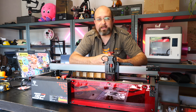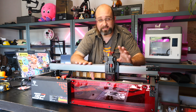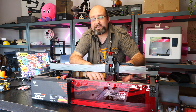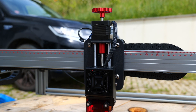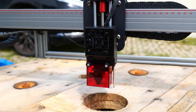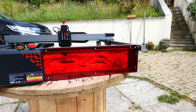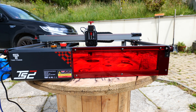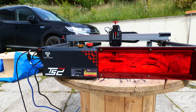You can see some examples of that later in the review. Let's talk about safety first, because that's always a concern with laser engravers. Included in the box is a generic pair of laser blocking safety goggles. However, it also shields the actual laser itself with a block, which should be sufficient in most cases. And on top of that, you'll find another laser blocking shield on the front of the machine, which should stop any stray beams or reflections from bouncing out horizontally at eye level, particularly with children.